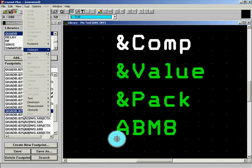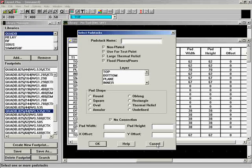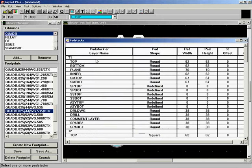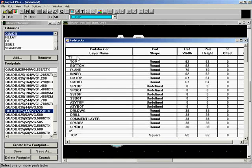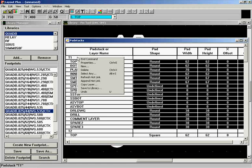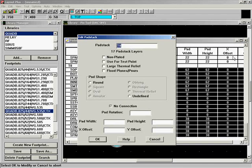To start making a new pad, we go to the pad stack. The pad stack works the same way inside the Footprint Manager as it does inside the actual layout tool. We're not selecting anything by default — you'll see predefined pad stacks T1 through T7, which are all through-hole components with drills. We need to make a custom pad stack for this part. Right-click and click New to add a new pad stack, then click Properties and name it something relevant — we'll call it ABM8_1 to keep pad stack names unique globally and avoid namespace collisions between different chips.